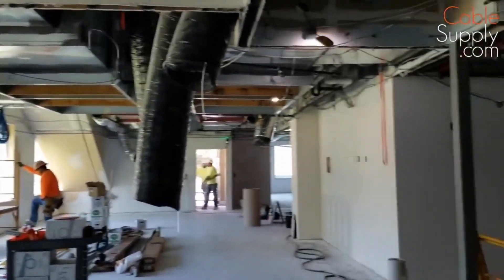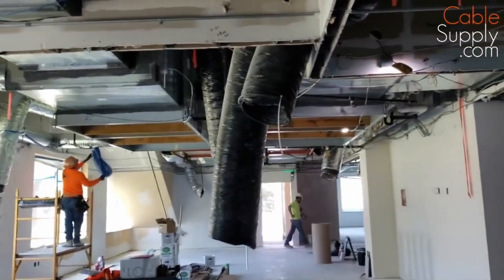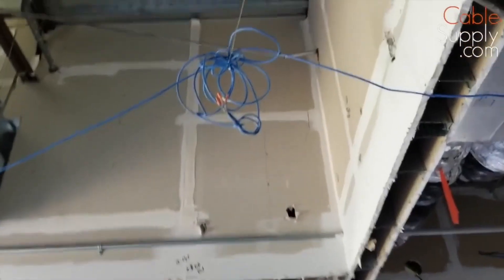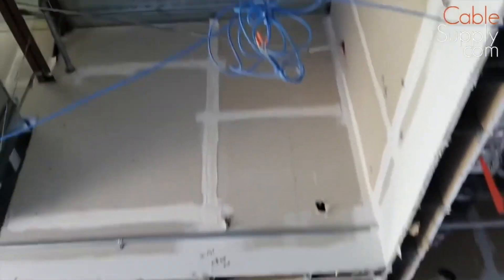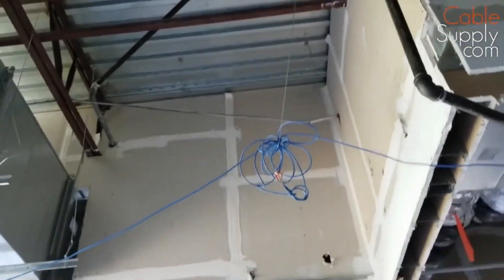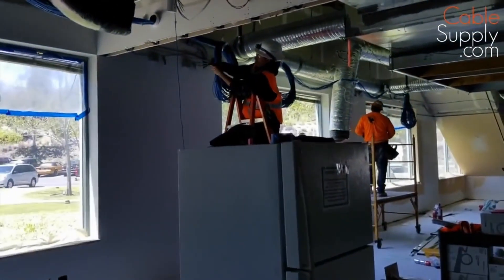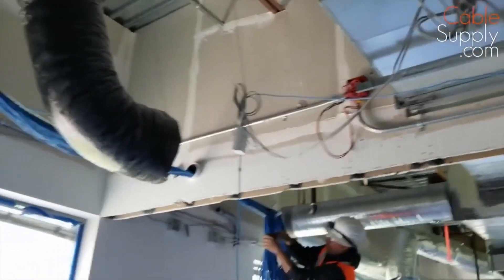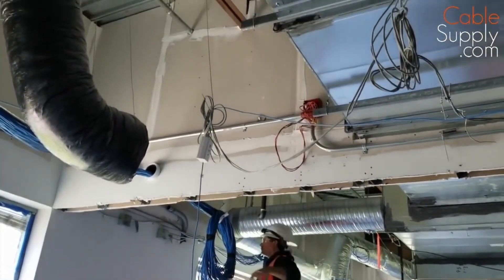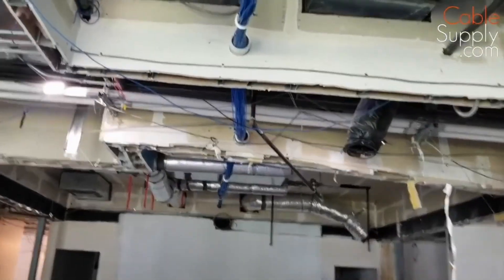This is a demo, so there's going to be a lot of old, sloppy wire from years past. You can see this wire right here — it has been spliced together using beans or jelly beans, beanies — used for splicing wire. You can't do that with computer cable. In this case it's just telephone. There are some of the old jacks there. And that red wire — that's some sort of control wire. It might be fire alarm, it might be HVAC, but it's not computer wire.